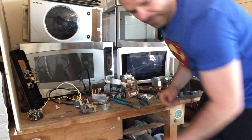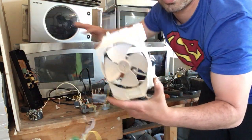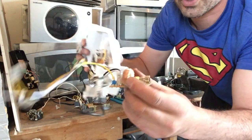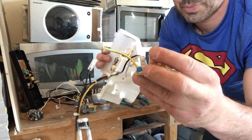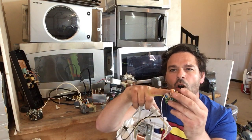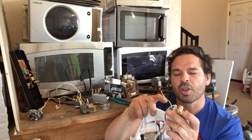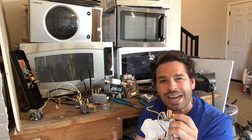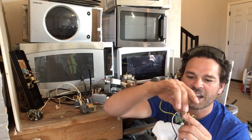They both also have a motor that comes off a fan — and if I turn it around, here's some copper from that motor. There is always a circuit board that has a small copper donut on it. This copper wire is always going to be number two copper regardless of how clean it is. The scrap yard will look at thickness — to be classified as bare bright it has to be thicker than 16 gauge, and this wire is not thicker than 16 gauge, so it goes into my number two.